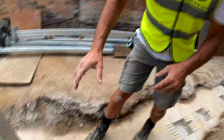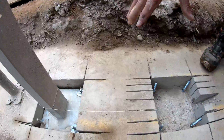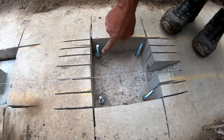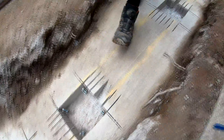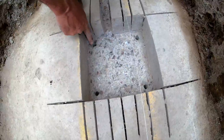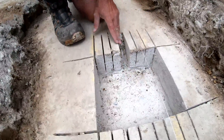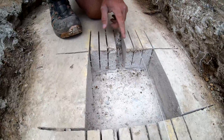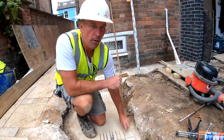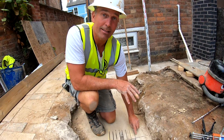The stages we're doing at the moment — this is the finished product as you can see. The next phase before that is chemically anchoring the bolts in and then setting the studs. The process before that is drilling the holes with the SDS drill. First process is cutting your pocket, which we've done. So what I'm going to do now is show you the drilling and then putting the chemical resin compound in to allow us to put the bolts and the plate in.